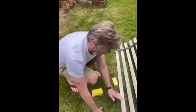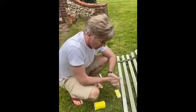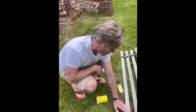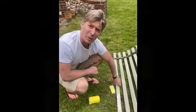Okay, that's our 2-part filler. We only filled it about 20 minutes ago, so that's given it enough time to go hard. We sanded it down, and now what was a hole is now a nice smooth surface ready for painting. So we're going to finish off our priming, and then we're going to be ready to start putting the colour on. So we're all primed.